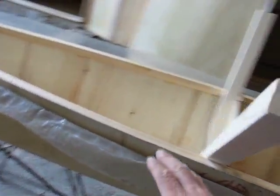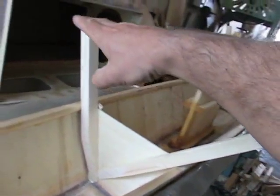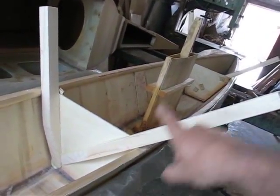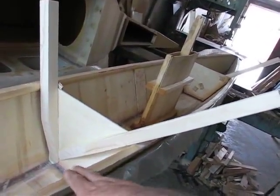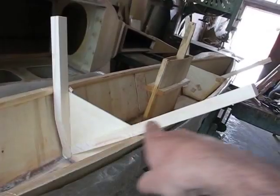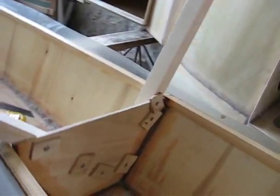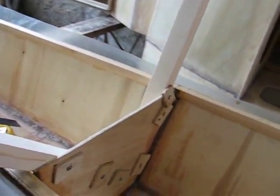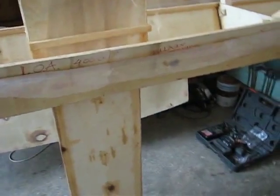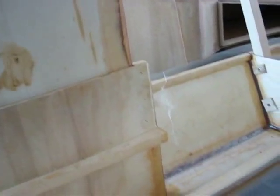So now I'm putting in these guys. I need another 20 and a half centimeters high. That's where the akas are going to come. A little bit more than 20 centimeters off the gunwale, higher up. So I'm gluing in these guys with PU. And later on, I'll change these screws for bronze or something. There's my dagger board in place. And yeah, works really nicely.